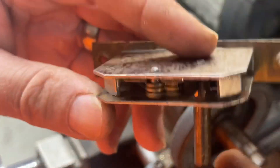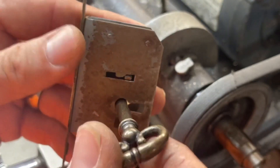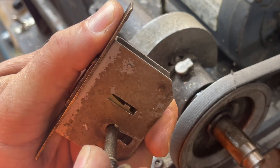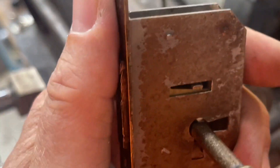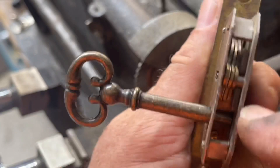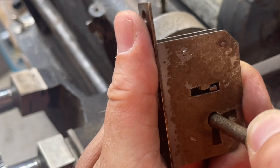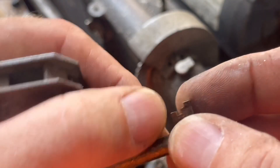Since I already knew the cuts of the lock, it was fairly easy to just come through and cut it out. Just like that. Let's give it a check. We can see one of our levers is too high — that would be the very first lever. So we need to trim that one down.